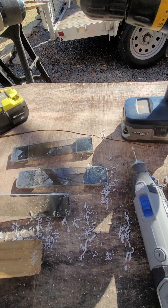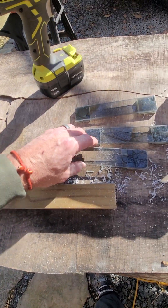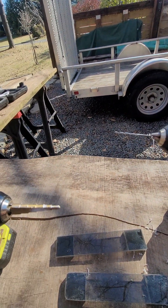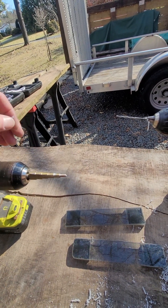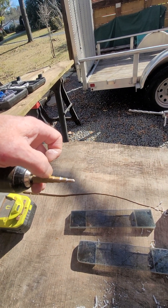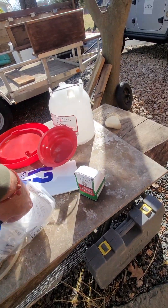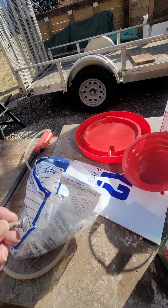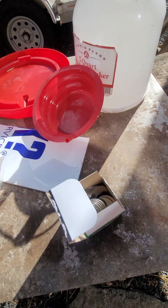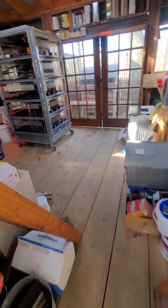I glued them together with super glue basically. I took them to my belt sander and cleaned them up a little bit, and then I have holes where I can drill the pilot holes with a small drill where I want them. The bolts I'm using are five-sixteenths — carriage bolts that have the little square on them. I go down to here about that far and then I use this Dremel tool to cut in the little recess for the carriage bolts. These are five-sixteenths by one inch and they fit perfectly. I'm using five-sixteenths washers by one and a half inch — it gives it enough support — and then wing nuts.